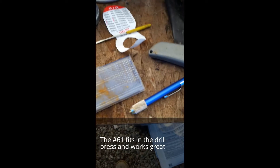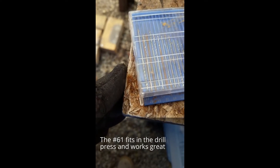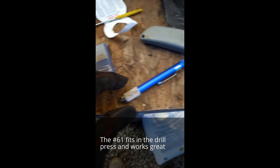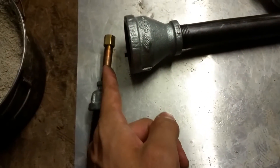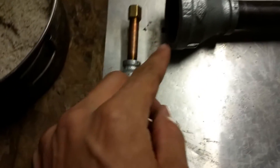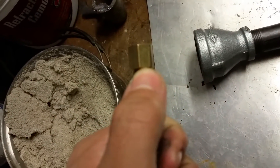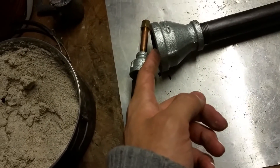I'm going to drill the end cap. Here are the drill bits I was talking about yesterday. The largest one I have here is the number 61. I bought these on Amazon, I think it was like $12. It comes with this little handle thing with a little chuck. What I'm going to do is drill through the side of this reducer for the 1/8 nipple, use a set screw, and thread it in on the side to hold it centered in place. I may actually drill through the end cap and the nipple itself for the gas jet and then center that with a set screw.